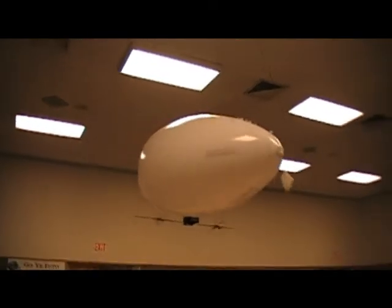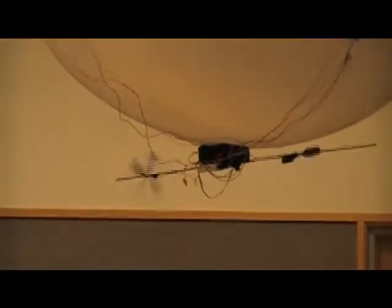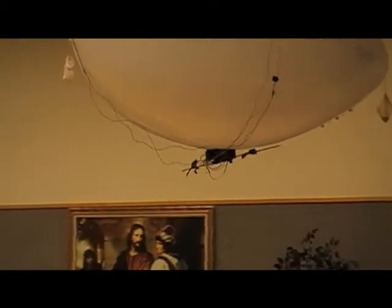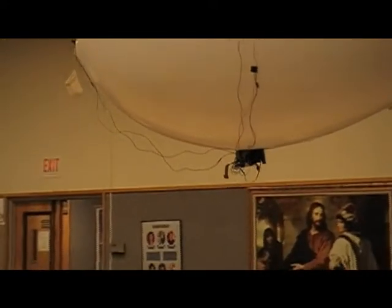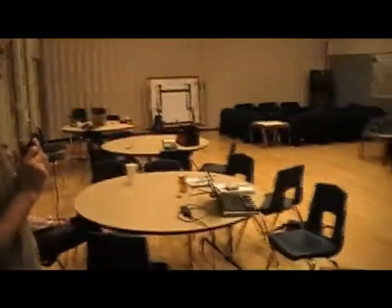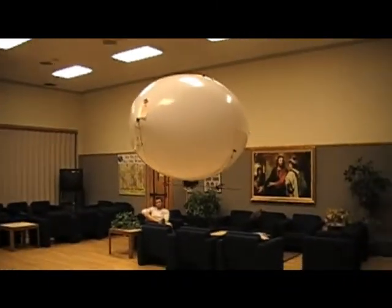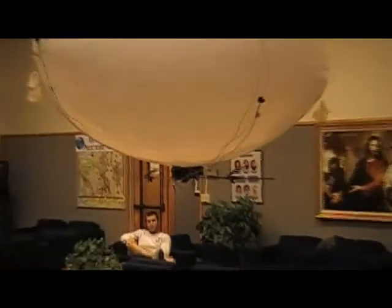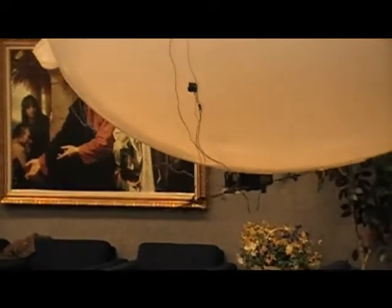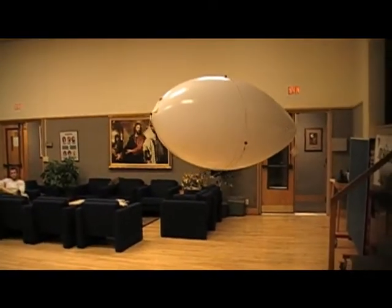The DualShock controller adds a level of intuitiveness and simplicity that we feel sets our control scheme apart from other similar projects. Most of the wow factor from our control scheme comes from the DualShock's tilt sensing capabilities. By simply tilting the controller forwards and backwards, a user can control the pitch of the propellers, thereby controlling the altitude of the blimp. The velocity of the propellers is then controlled with the analog triggers found on the shoulder of the controller. In conjunction with the square button and the right D-pad, we have bidirectional altitude and velocity control.